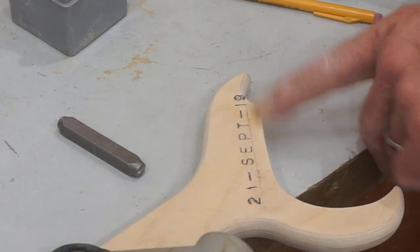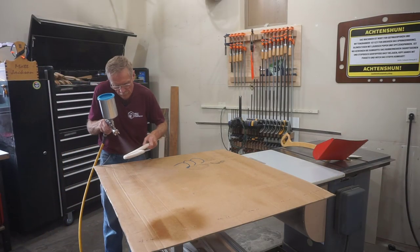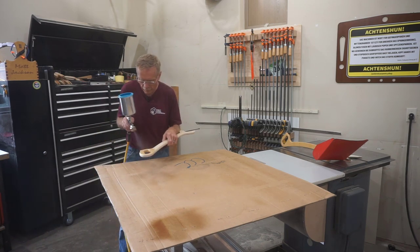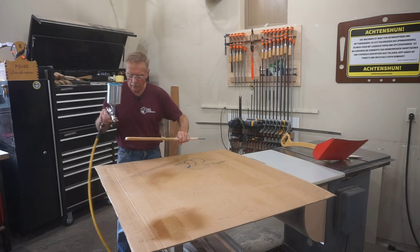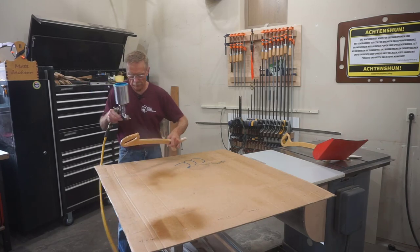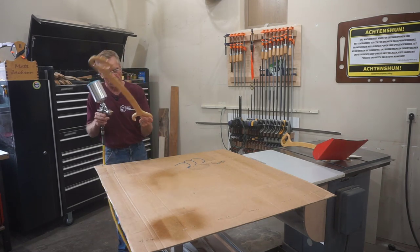And I'll always remember how I should have spaced those letters out just a little differently. A number of viewers have been asking questions about my finishing process, and one of these days I'll get around to that. But I couldn't justify it at the end of this video because I need to get it produced and uploaded. But suffice it to say, I use a gravity feed cup gun and Sherwin-Williams pre-catalyzed lacquer and apply two coats to projects like this to get a fast, excellent, durable finish.